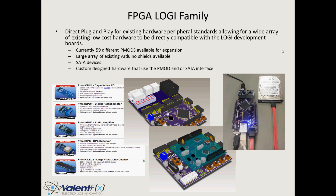This slide shows how the Logi family is able to interface with multiple different hardware interfacing standards currently on the market. One frustration is seeing hardware expansion boards available for only one platform — getting them to work on another takes custom wiring or other interconnect work. So we designed the Logi family to interface with widely available, low-cost, easy-to-use standards with wide versatility. PMOD is one of those — Digilent currently has 59 different PMODs of all types, including Capacitive I/O, Digital Pod, Audio Amplifier, and more — making it very easy to plug directly into your FPGA development board.